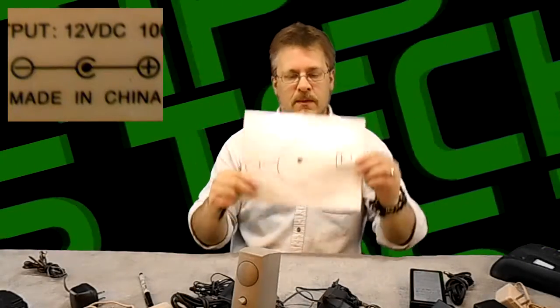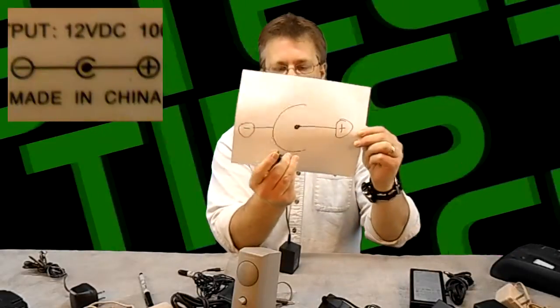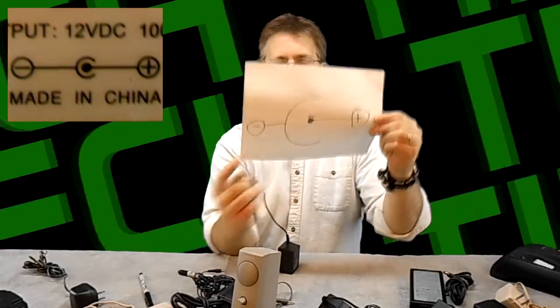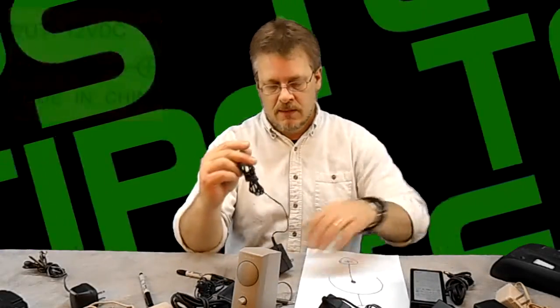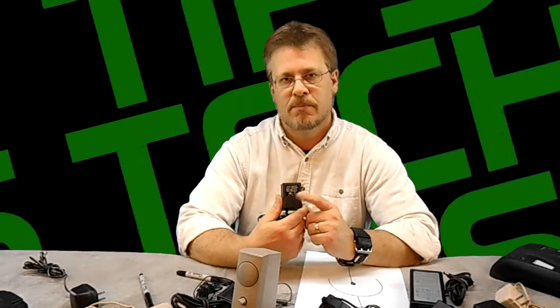The other things you have to be concerned with are the plus or minus center voltage. We'll put a little demo up here in the corner — on a plug such as this, there's a center and then there's an outer casing. This is showing us that there's a positive center and the outer casing is negative. Generally this is always the case, but there are negative centers and positive casings. If this is wrong, you can blow up the device. So make sure the tip — either plus or minus — matches exactly. There is almost always a little picture on the actual device or plug, so check that out.